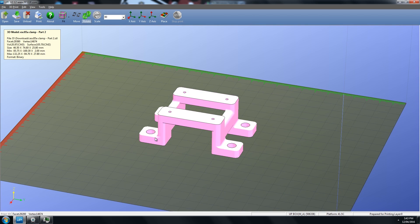So the first step is to consider orientations. I designed this specifically by ignoring overhangs, so this will have to have support material — I went with function first instead of sacrificing function with unnecessary material to make it easier to print without support. The UP prints support really well, so it's not a concern to me.